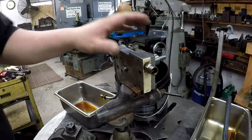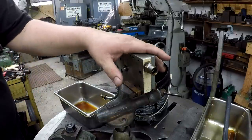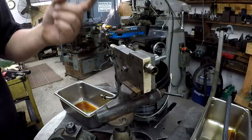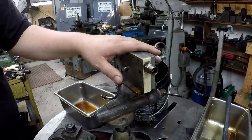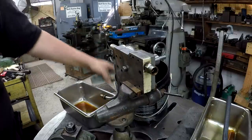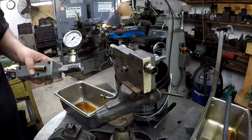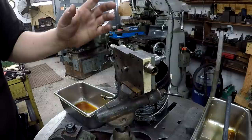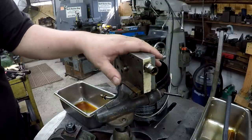There are other things to consider. Your operating context for the pump is what you need to consider. You have your flow and your RPM. I know what those are supposed to be, and that's what you really need to check. Not only is it building to the proper pressure, which is going to be the resistance, but are you pumping 2.5 gallons per minute at 859 RPM? That's your operating context right there.